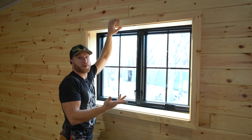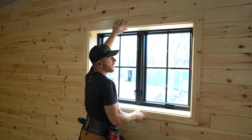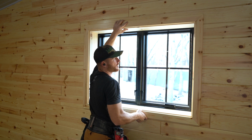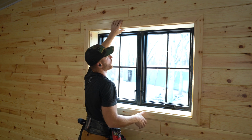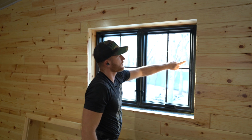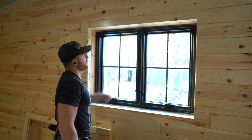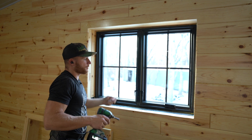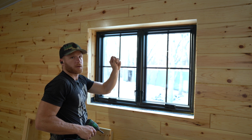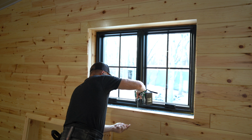So I got these pre-made window boxes with casing already installed, but how do I get it to be perfectly squared up and lined up with the window? Let me show you. I built these window boxes to be flush with the outside edge of this window. To get that to line up perfectly, I'm going to take some screws and screw right through the window frame